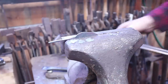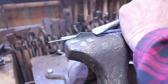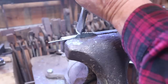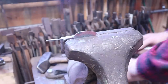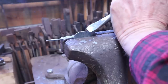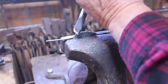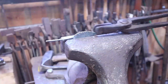I've sharpened up my finest little hot chisel. These cool down to the point they're not really very hot by the time you get to cutting the little serifs in the edge of the leaf. This really makes for a better looking leaf though if you do this. It's so thin it cuts easily cold. I go ahead and heat it between heats just to keep it normalized and a little bit softer — easier to work with. Less risk of breaking something like the stem off. Be careful back here — if you slip, you accidentally cut that stem off. Yes, I've done that.